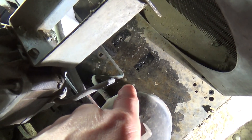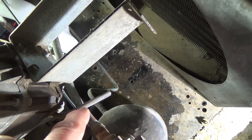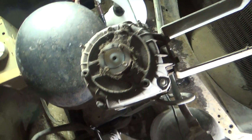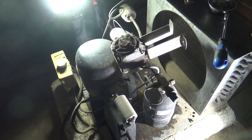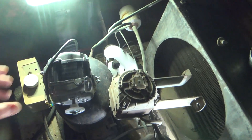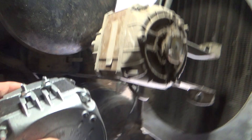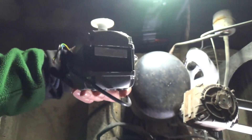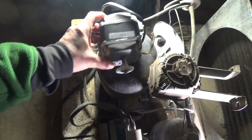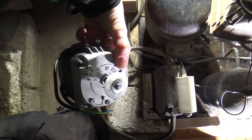Although actually we might be lucky, because there's three sets of holes down the bottom there. So we might be able to move the bracket back and make something line up. That's probably the original motor and I think this is 22 years old, so it's done well. We have got a 34 watt motor. You're matching with the stack height - so where the windings are, that's a good guide for matching up the duties. The bigger the motor, the thicker it is. These are the Italian Polestar ones - supposedly better quality motors than the Chinese Polestar ones.